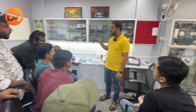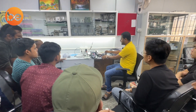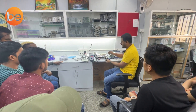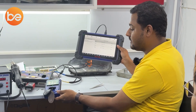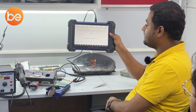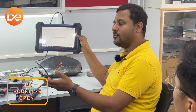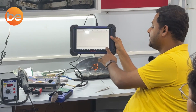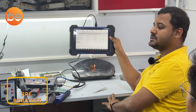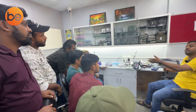So what can we do now? We just need to place the key here. Click on the first key slot and click on 'Make a Key.' When prompted to save the newly generated file, click no. Function completed successfully — the first key is saved to the hardware. By using this method, you can give a solution to the customer when replacing with a new ECM.